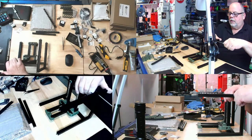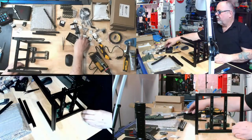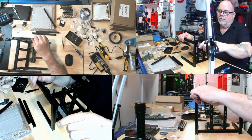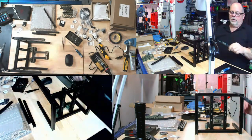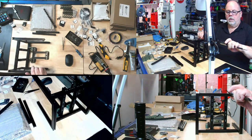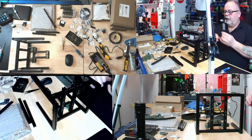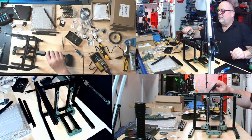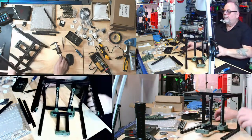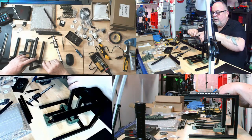And then give a little gentle pull, and then measure it again. I suppose I could if I want to be real, real anal about it. And I'm still, oh, there. 37.0. We come back over here. See, now it says 36.8. Make sure, 36.8. But if I turn it this way and actually measure it so I can see what I'm doing, 36.8, 36.7. Okay, so maybe I want to take this one and just loosen it off a hair and pull it just a smidgen that way.